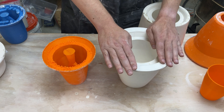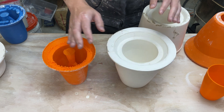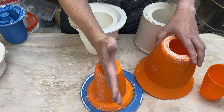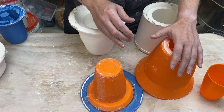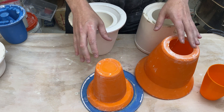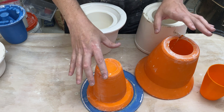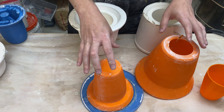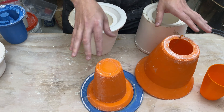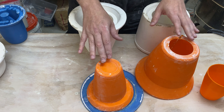We'd also end up with a whole bunch more 3D printed pieces to attach and detach — at minimum doubling what we have now: half the inner mold, the ring, half the outer mold, and the other side as well. We potentially could reuse the mold and just cast twice. But there are many more seams with the same problem of needing a secure seal against leaking plaster, yet still being able to unseal and pull the plaster once cured. And there's all the software work to do that automatically — it would defeat the purpose if I had to cut up the mold manually.